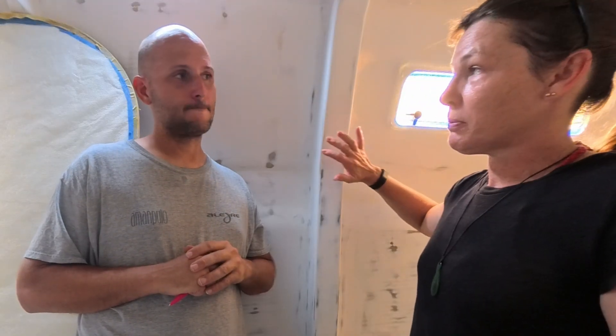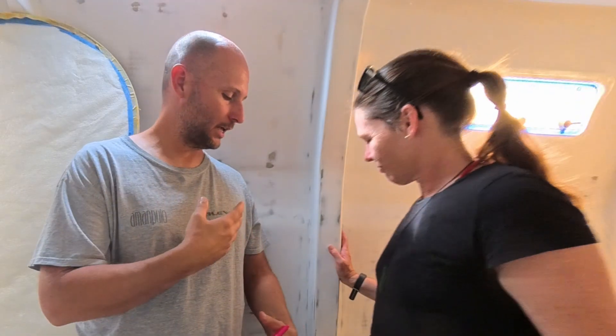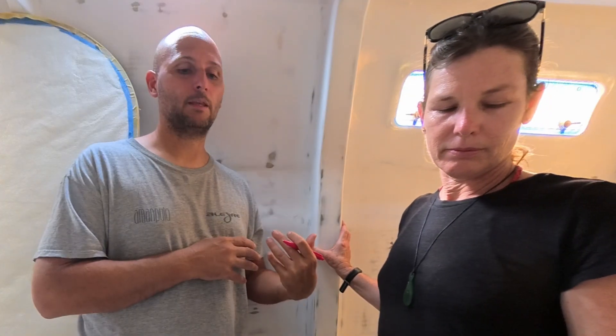Tom's got a good one — I-beam instead of a box beam. Yes, very good option. Aesthetics win out here. You've got to always look at the overall finished picture. An I-beam technically would have worked perfectly fine here. The issue would have been that living with an I-beam in here would have been horrible. With the box beam, it's very easy to walk past, not get snagged on, and it's very clean and easy to maintain as a finished product inside the boat. Technically speaking, an I-beam would have worked and actually been a lighter scenario as an engineering problem — an I-beam would have been better. But as a practical cruising boat solution, the box beam is a better solution.